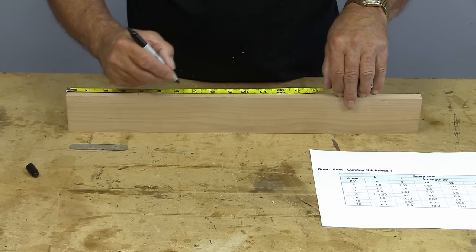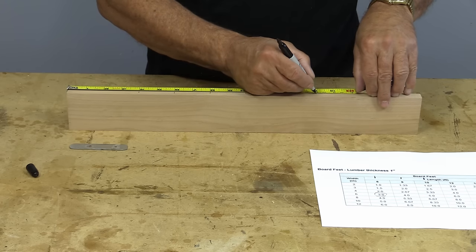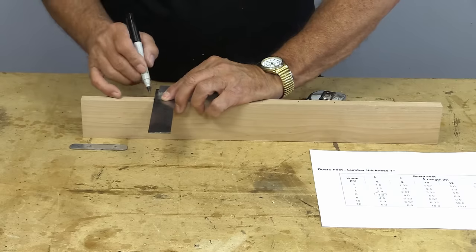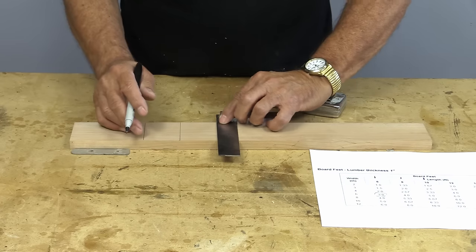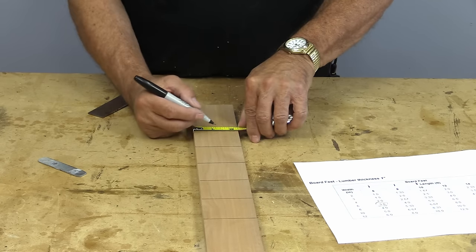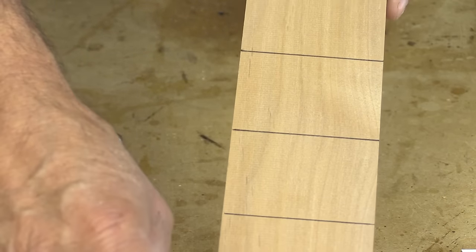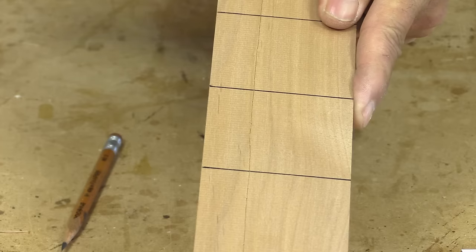I'll mark 4, 6, 8, 10, 12, and 14 feet — just because we can. I'm going to use those as a reference to start making my marks down here so you can watch as I go along. Now I need to divide this into thirds — this is a two-and-a-half-inch-wide board so I'll have to do the math on that. I found the third marks and I'm going to use my marking gauge to run a line on each side of the board to give me a place showing where each third is.